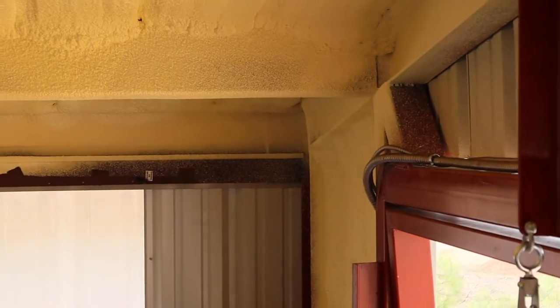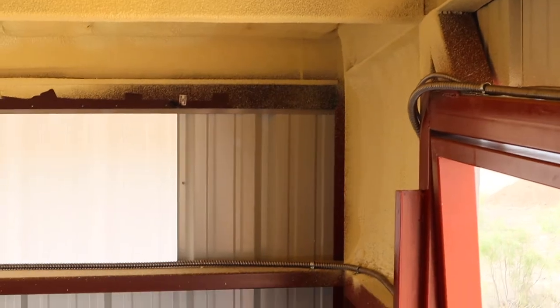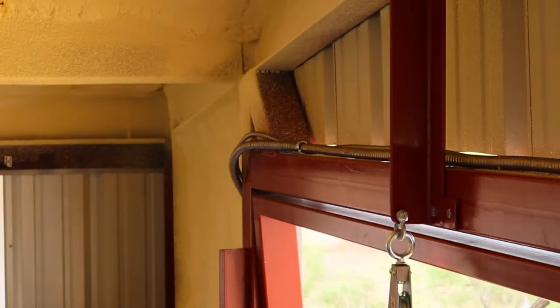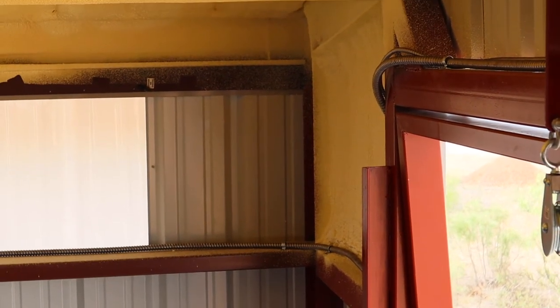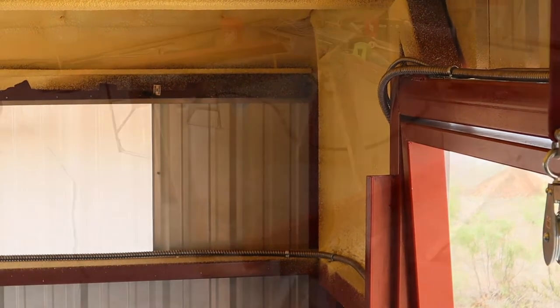I can't really tie into these purlins because they're just light metal. They're really only meant to hold on the sheet metal. So whatever I do is going to have to be coming off that I-beam in the corner and this header. It'll have to have a brace, and it's going to be holding all the weight, so something strong.